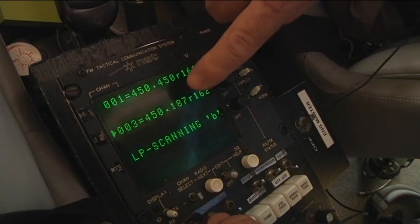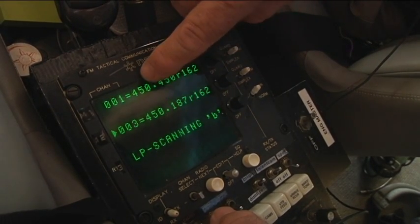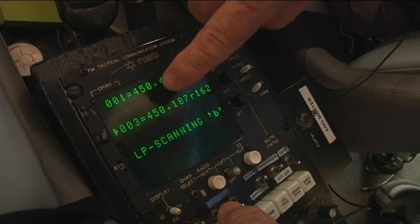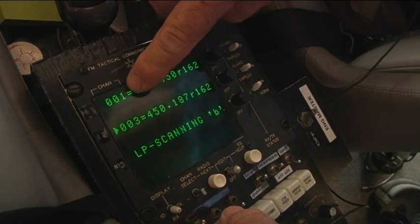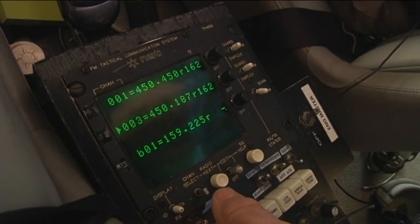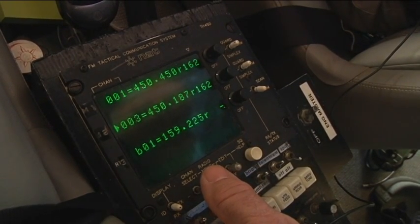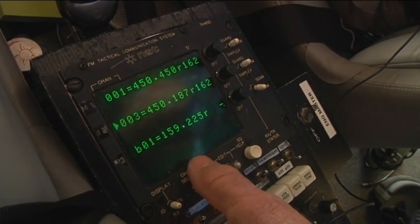Normally, ENG is set up on 3 when 1 is tied up. So you can contact ENG on either 1 or 3. The assignment desk will generally always be on channel 1, on radio 1. And as it turns out now, usually we can also talk to master control or satellite on channel 1. Radio number 3 can be scrolled through either A, B, C, or D banks, and that gives us forestry and Coast Guard frequencies, and some police agencies' frequencies are programmed into that also.